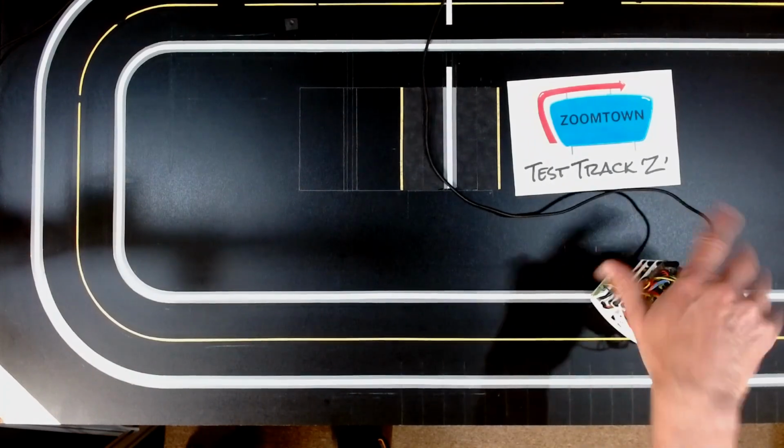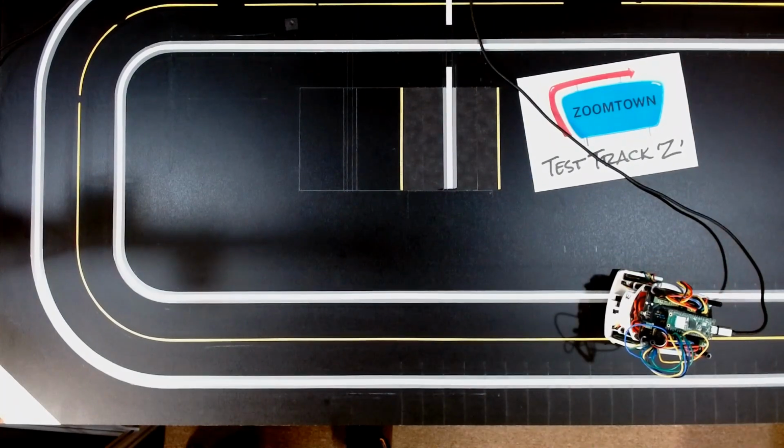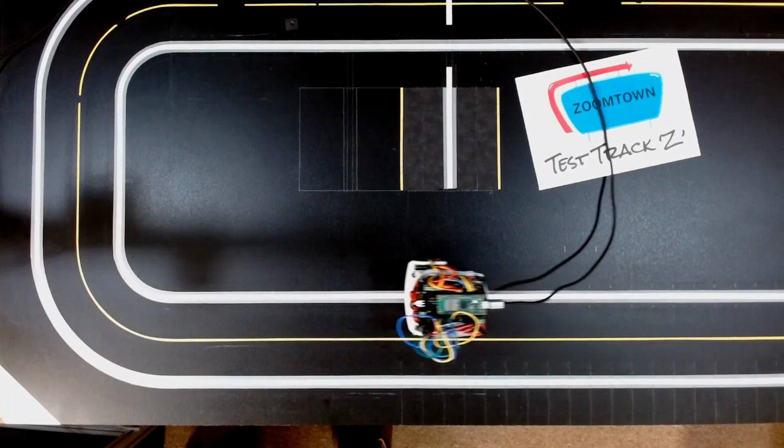I would say that's a pretty robust system for line following. I'm pretty happy with how well that recovers and behaves. Now that's just using a proportional control, not the integral or derivative of a full PID system. Generally, in this type of activity, the device that you're controlling with PID, if you were to knock it off like I am, it'd just sit there and wiggle around for a while and finally settle in. There could be all kinds of nasty hyper behaviors. In this case, with just proportional control, I am thoroughly and very pleased with how it's behaving.